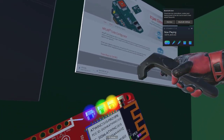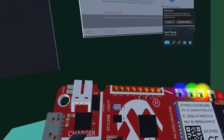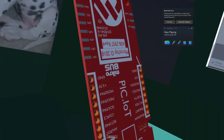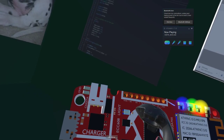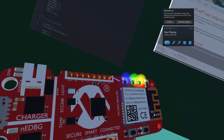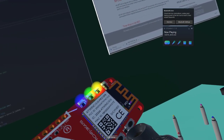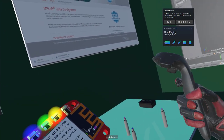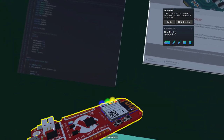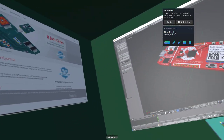The broker is sending data back to us, and we're communicating as we expect. So that's the general walk through the entire behavior you'd expect from this board. You can go into detail about the publishing and subscribing, basically sending information from the light sensor, from the temperature sensor, using I2C here, using the ADC sensor here, or you can have the different push button behaviors that affect it. You can go into deeper descriptions about how the yellow LED may become static on or whatever based upon a subscription that's received. But in general, you can walk a user through everything.